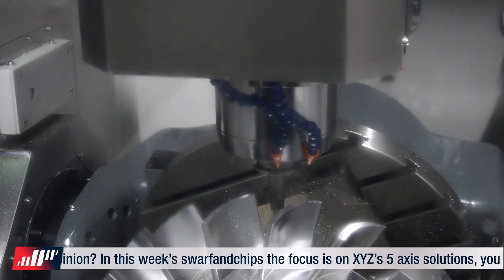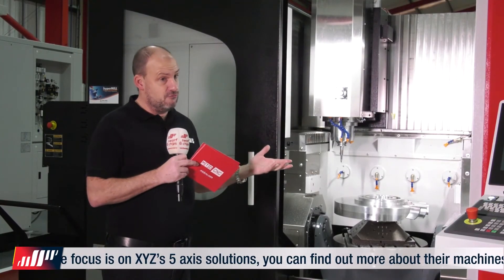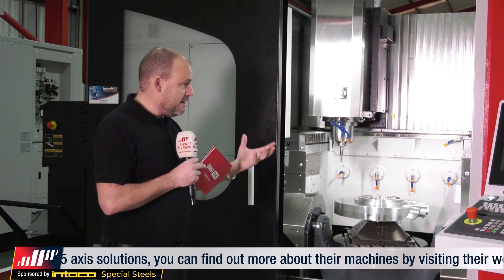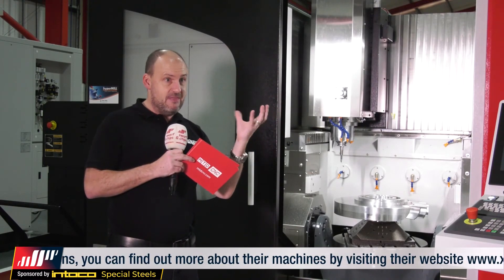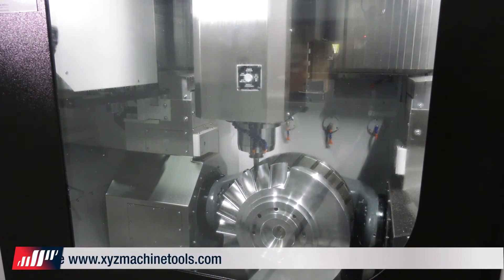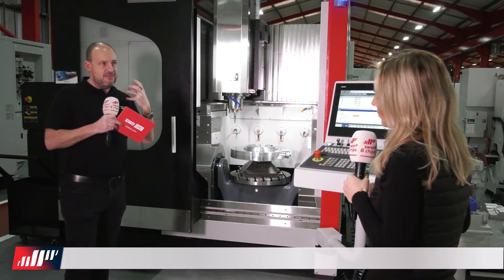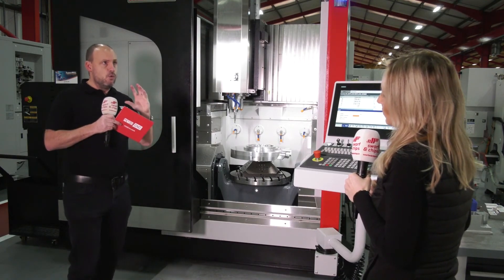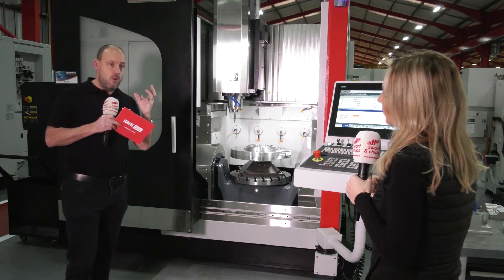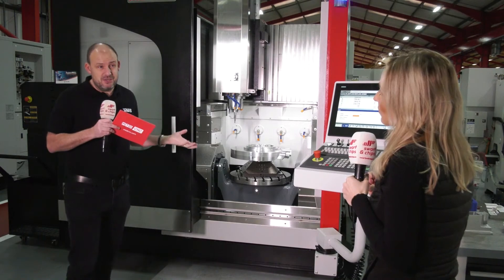You don't want backlash when moving a part up to 600 kilograms. When you're having that weight on the table doing movements every day, 365 days a year, it's not going to take long for a table to potentially wear. It's also a 90 RPM table, so rotational speed is 90 RPM. That's very important when looking at smaller, nimble parts doing lots of quick operations point to point — because if it were 20 RPM, it's not going to be as fast. The machine is quick as well as rigid.